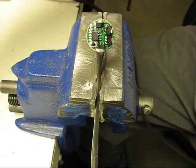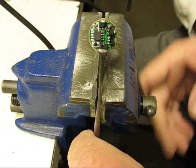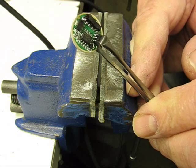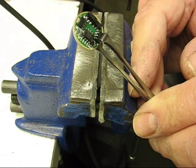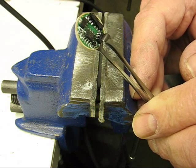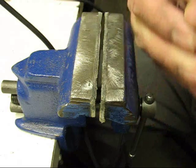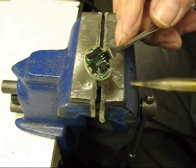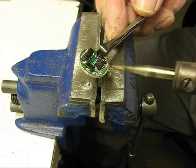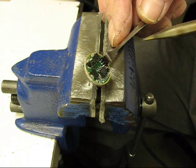That's that simple — and I know it's not that simple. These things are tiny, it takes a lot of practice. You just got to remember to use quite a bit of flux. Don't be afraid of the flux. Rosin core is not going to hurt the electronics or the parts. Acid core wouldn't be a good thing. Use a good hot iron with a real fine tip and just a tiny bit of solder on the tip. All you got to do is really just walk right down in there and touch them. What I usually do is go straight up and down — I did it sideways because I wanted to show you. Normally I'll take my iron and go straight up and down on a pin and just drag the solder across it.